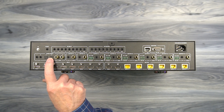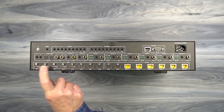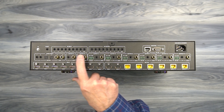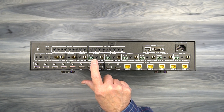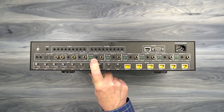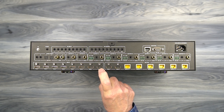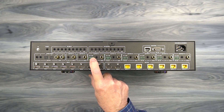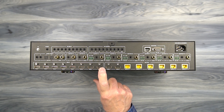Above that are the audio connections. On the left is the audio input block where you can use an analog left and right 3.5mm connection, an optical connection, or a coax connection. You'll also find eight output connections — the first two offer both analog left and right and a coaxial output, while the other six correspond to your remote locations. There's also an RS-232 connection block there because the remote receivers can transfer RS-232 control signals back to the primary site over that same LAN connection.